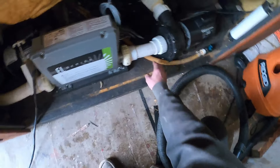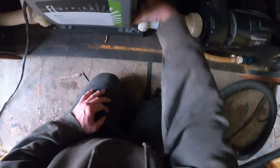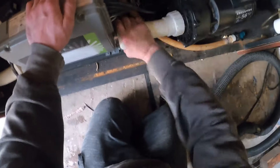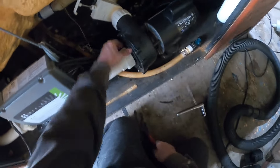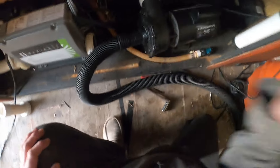Your next bet is to actually access the equipment bay, which will be directly below the topside controller or the side of the tub that has vents on it. Upon looking in the equipment bay, check to see if there's any way you can remove any split nuts or pump unions to access the pump itself so we can vacuum out those lines. Shop vacuuming these lines out this way is your best bet to eliminate all the water. I usually suck on the front end of the actual pump and then come back through the heater side as well.